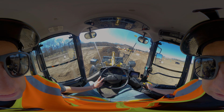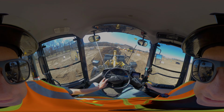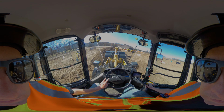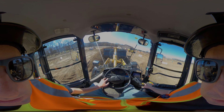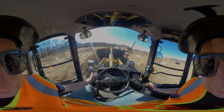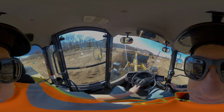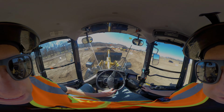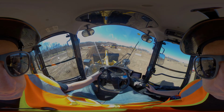While I'm doing that, now I'm in there, I'm going to start pulling back on my right hand to drive into this thing. And then right up around my dash, I am curling up as well. And there we go. We got a nice full loaded bucket. I'm in reverse, checking behind me, looking in mirrors. And as I'm backing up, this is where I start bringing it down so I can see over it.